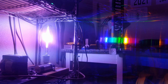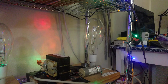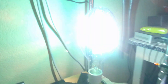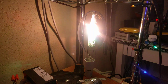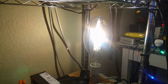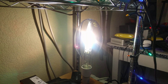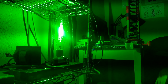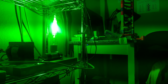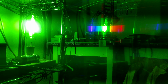The next lamp I'm going to turn on is my Plusrite GDX green metal halide lamp. I've just screwed in the Plusrite 400 watt green GDX metal halide lamp into my fixture. Let's turn it on. Very nice greenish startup because of the thallium halide salts ionizing on the bottom electrode of the arc tube. I'm going to let this lamp reach full brightness and then measure the wavelength.